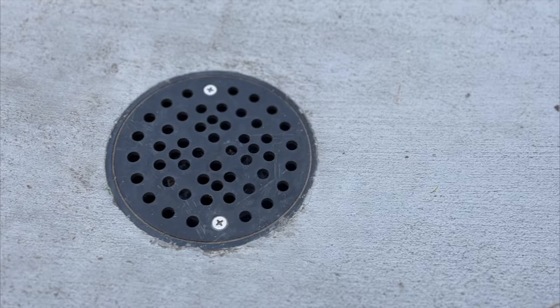Here in Utah, I'm at our basement finish that we are just wrapping up — a basement walkout entry in Harriman. What we're doing here is we have a slab at the bottom of the stairs, four inch concrete sloping down at least a quarter of an inch per foot toward the drain. That's the first step in making sure that you don't get a flood.